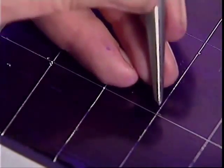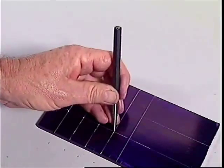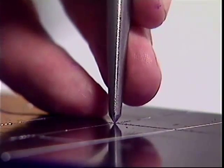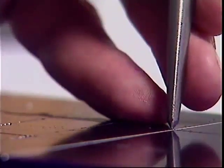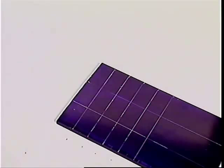There are some points drawn on this plate to help locate a hole to be drilled in it. A prick punch is used to mark the points so they won't rub off, and scribes some intersecting lines between them. Its point is very sharp so a gentle tap leaves a clear indentation, making it easier to draw lines based on permanent marks.